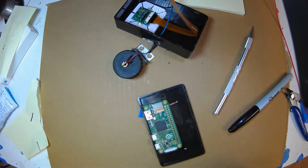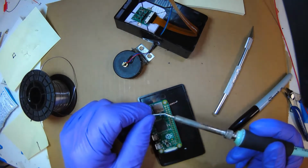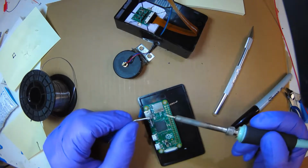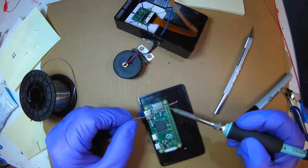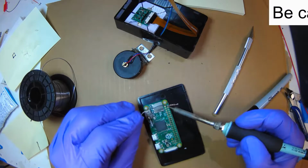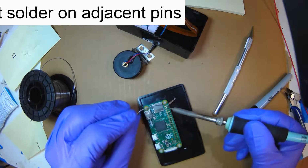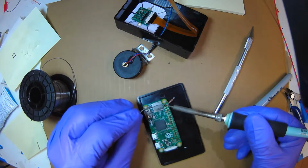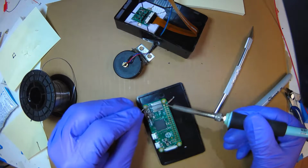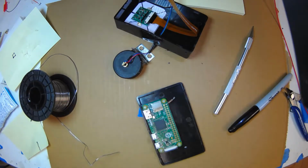Okay, so you take your soldering iron, I clean the tip, I put a little solder on to wet it, then I put the wet part right on the circuit board. I hold it there, let the joint get hot, then feed solder onto that. Oops, now I have a bigger bead. I'm going to put that bead right on it, so it's thermally conductive. Now solder, I'm touching the joint, not the iron. You can see how hot it is. It's just flowing. That's beautiful. And then lift, let it cool by itself.